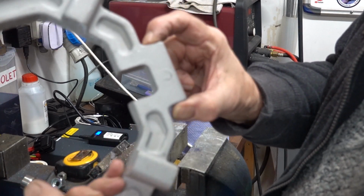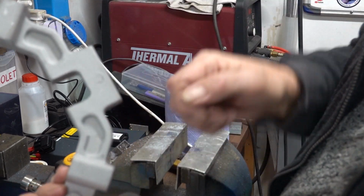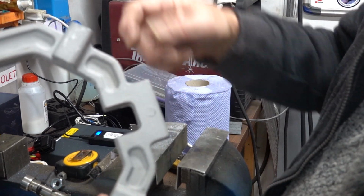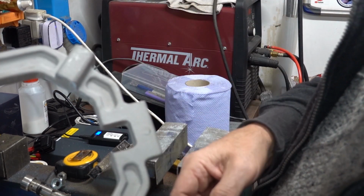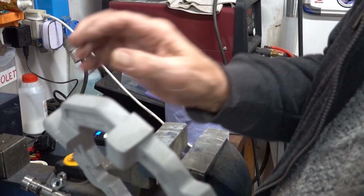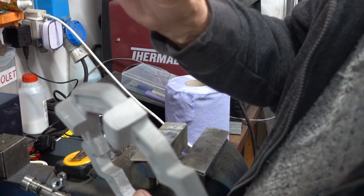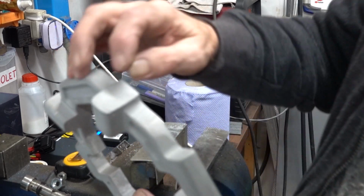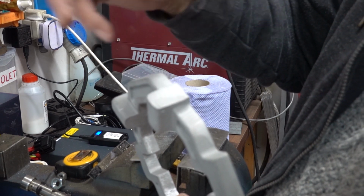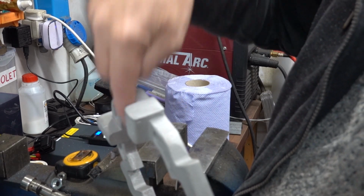This then is the clamp, which will have a slot cut in here, a drill hole in here, and a swivelling bolt which has got to be made, and a thumb screw on the top to tighten it down there, so that'll be drilled. Then these have got to be drilled with a lot of holes. There's the master, which carries the main bore with the fingers on, and then there's the follower, which is a threaded rod which you drill and thread through here. I'm not sure if it's the back or the front, which is the M6 threaded rod with a thumb screw on, which draws the fingers in and out.